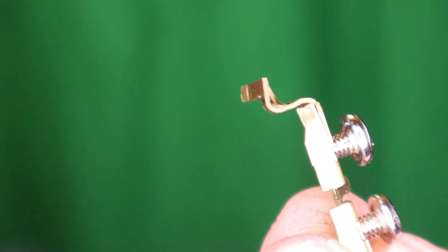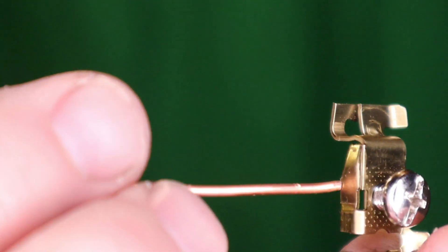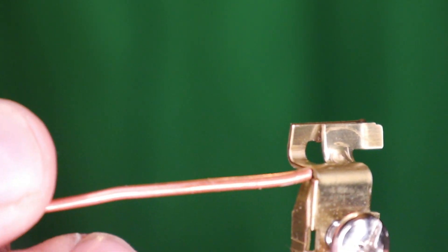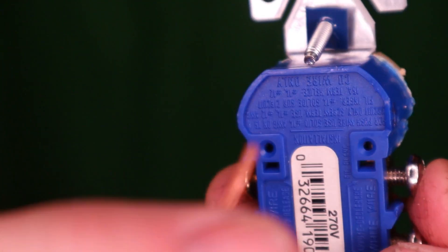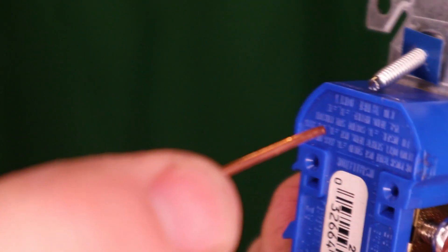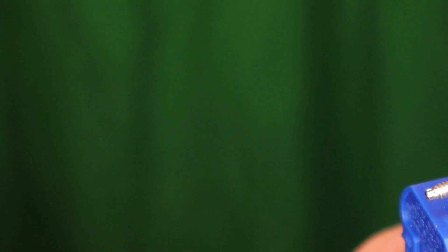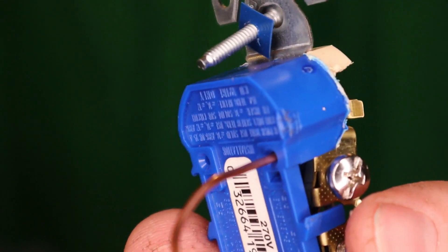So with it sitting there, as you can see — good picture now — when you push your wire into it, it goes right underneath this part right here. It sits in there like this. Now I'm going to go ahead and push it in on camera so you can see and understand what I'm talking about. All I have to do is take my wire — this is 14-gauge wire — and push it in just like so. It's a bit hard to do because I cut the receptacle apart, but it's in there like you would normally do.